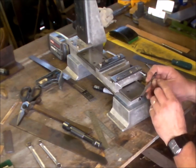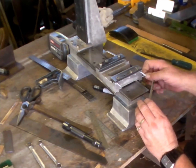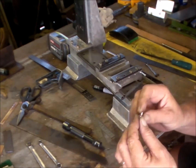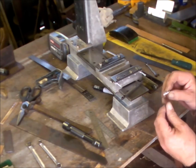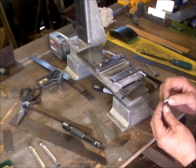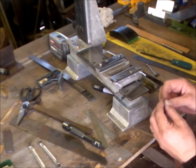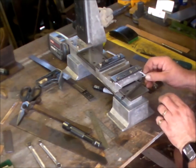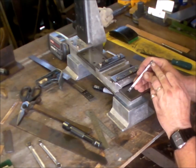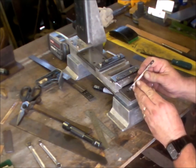I've already drilled these, but just to explain how I got that position — it's quite simple. The ends of the two outside screws have been ground to a point. These screws are too long, but being this length they will go in far enough that the chuck doesn't grab the screw head but grabs the shank. With the drill and the bench grinder, I turned this to a relatively fine point — same with the other one. Those fine points give me the location on the gib by scratching a mark where those points make contact with the gib.